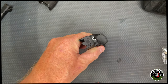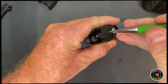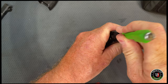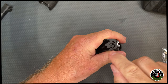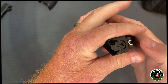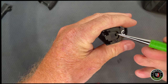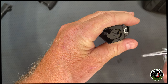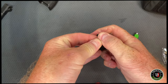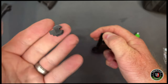We're going to take this — I'll get a smaller punch, that ought to work — and depress that. When we depress that, we're also going to slide the whole thing forward, because what we're trying to do is push this plate forward. Next you have to put your finger over this whole thing, because this and what's behind it are all under spring tension. I'm going to put my thumb over it, cover it up, and slide that off. There's your little plate that came off.